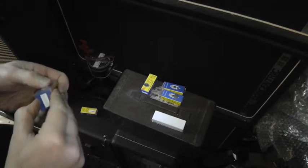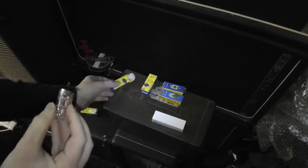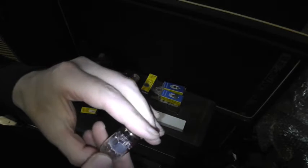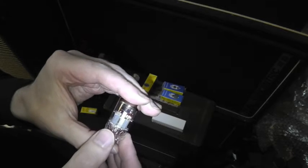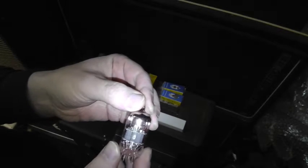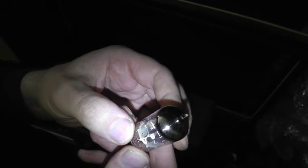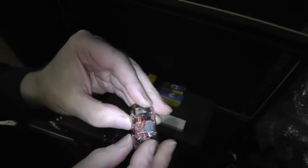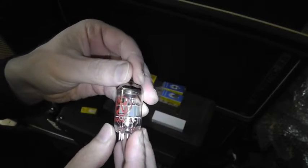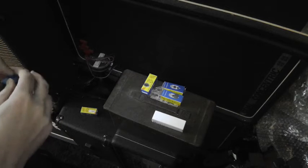Okay, so what have we got in here? Okay, so this is a JJ, a genuine JJ. Now, these are sort of okay. I like JJ's EL34s. These are okay. New production valves, it's hard to find decent ones. You can see the micas are good. They contact the glass in lots of places. The problem with these is the plates are very short, which seems to be less good for tone. These are ECC83S's. There is an MG version that JJ do which has longer plates. And that's what's in V1 and 2 of that amp that I just showed you, is the MG version, but it's more expensive.